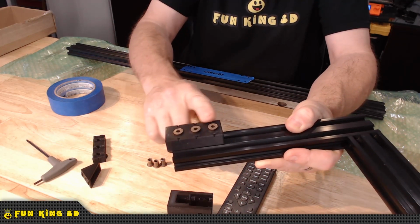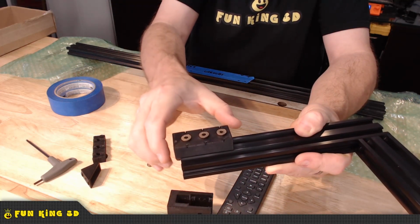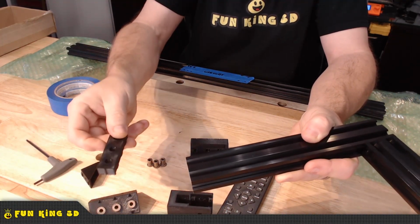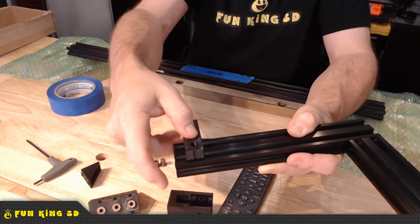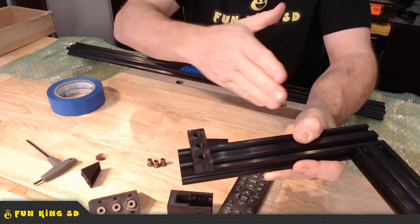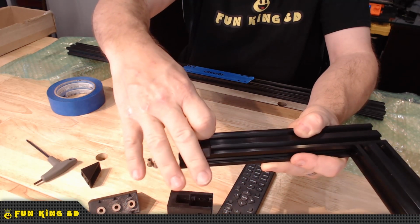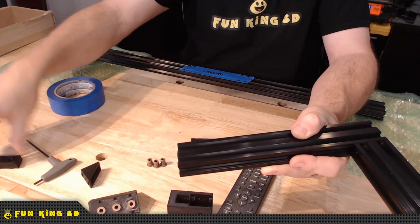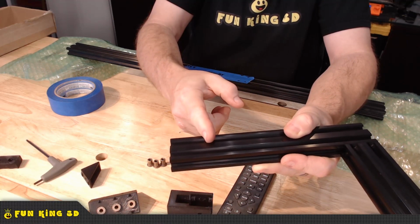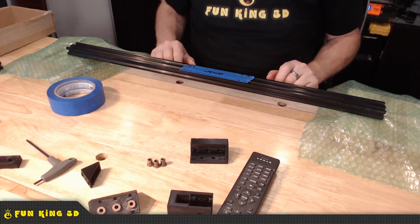Now, this particular design I made, you can see these little arrows, and that's actually for measurements. But I don't think with the guide on the end of this, that's necessary. But I am working on the design of another piece here, which has got an end guide or end mark as well. And that can go in because we've got a couple spots where we have to drill in the middle of the extrusion for the bed supports. And it will work the same way. I just have to put the retainers on it. But then you'll be able to measure from the end to the center point on that to know that you're going to hit the middle of the hole to be able to mount the cross supports, the cross members, if you will.